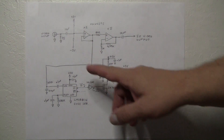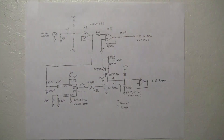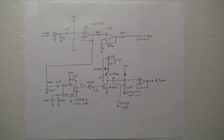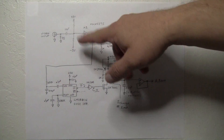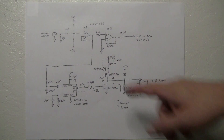Because of crossing the capacitor and going into this FET input of this op-amp, this line has lost its DC reference. So I establish an artificial DC reference by tying two 100k-ohm resistors between the plus and minus 5-volt rail, placing this line at approximately 0 volts DC. This holds the entire video waveform within the operating range of this amplifier.